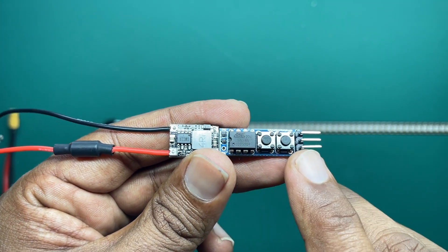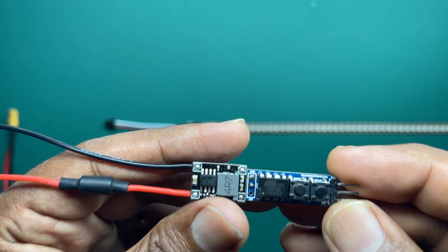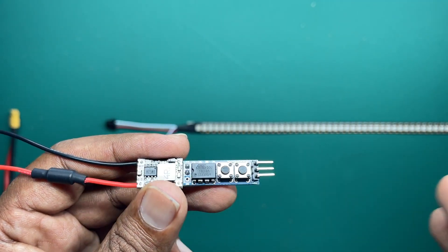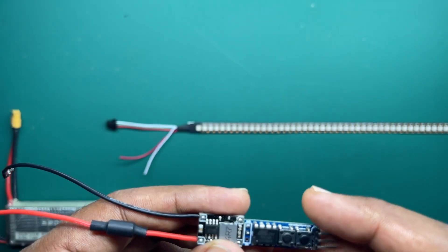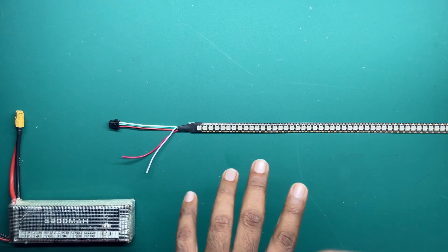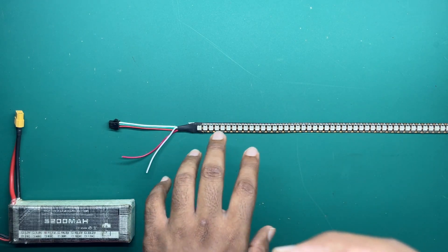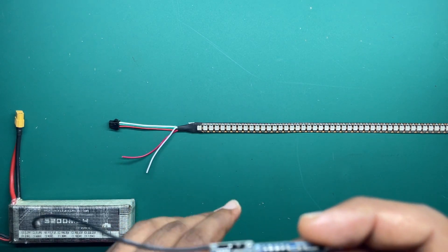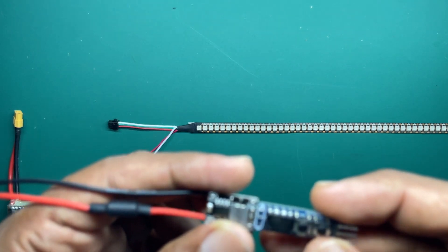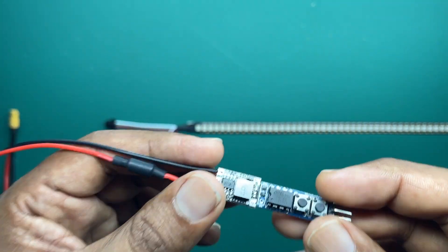This is programmed to support LEDs from 30 up to 60, so you can choose 30, 40, 50, or 60 LEDs as required. Here I'll be using a 144 LEDs per meter strip for illustration, since the full 60 LEDs per meter strip wouldn't fit the screen. The ideal strip for this project is the 60 LEDs per meter strip because it consumes much less power, and the controller can handle that number of LEDs very easily.